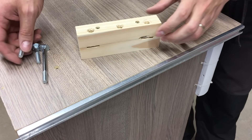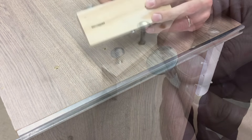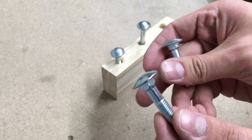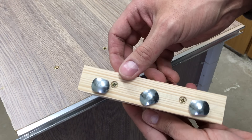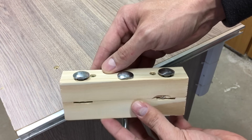For sliders I used carriage bolts. Carriage bolts have round ball heads, so I ground two sides to make them fit in my rail. The side bolts will act as sliders, and the middle one will tighten the whole mechanism up.